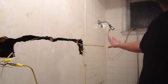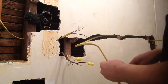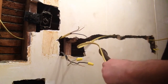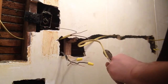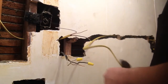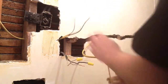And then we're going to deal with our switch right next to the shower. I'm just getting all my wires stripped to the point where I have around 6 inches. This is interesting wiring — I've never seen a gray-white wire.